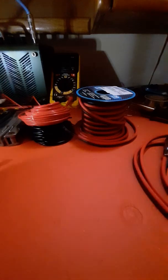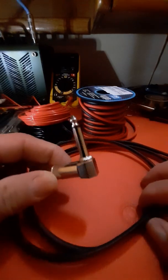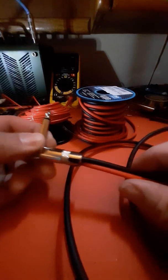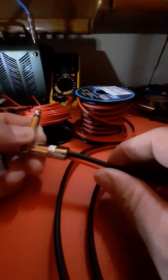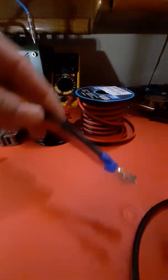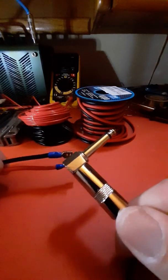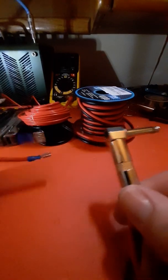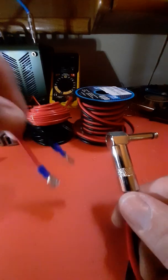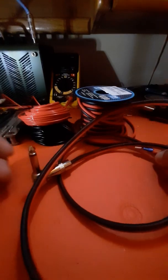The last part: if you don't have a cabinet, since both my amplifiers are 8-ohm I built a speaker cable out of the 12-gauge speaker cable. I used two spade connectors on one side — one positive, one negative — that goes to the speaker of one of the amplifiers. When I want to test the speaker of one amplifier, I connect this cable to it, don't turn that amplifier on, use it as a cabinet, and then use the speaker out of the amplifier that is on. And vice versa — it's a quick test connection but also a very useful cable to have around.